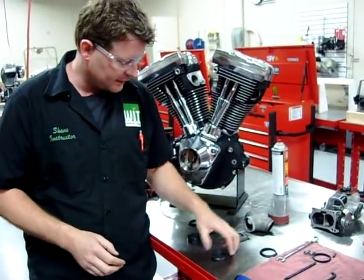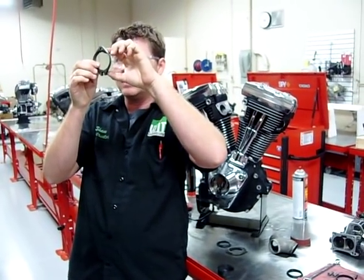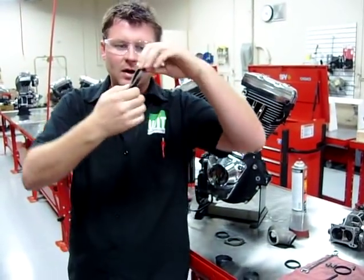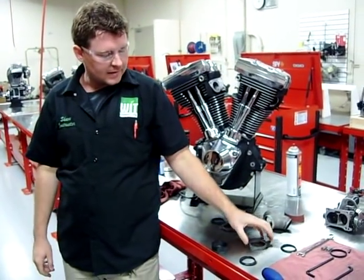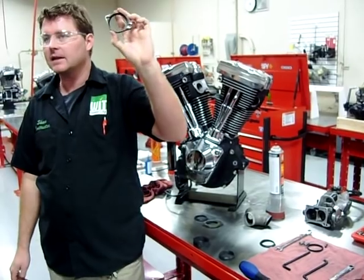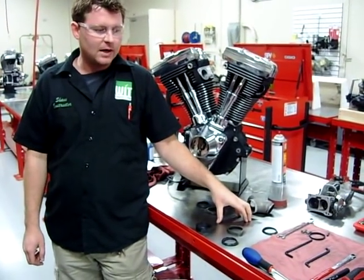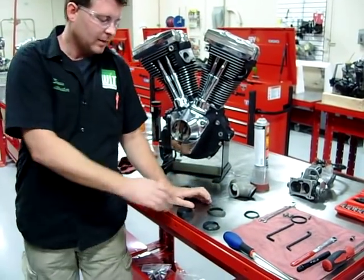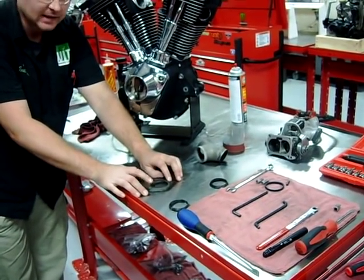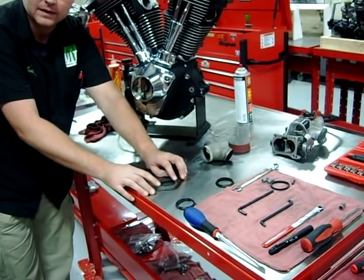Let's talk about other problems with Harley-Davidson intake manifolds. We only have two bolts and we're clamping down over a pretty large surface area. These work great if you do it right. If you do it wrong and you take one and pinch it all the way down and then try to pull this one over, this flange is going to bend — and these do bend. A lot of times, especially on a high-performance motor, I just put new ones on. You can buy S&S or other brands; I think 30 bucks or so you can get a new set of flanges, chrome if you want. What we want to do is check flatness — this bench does not count as a true surface plate. We'd go to a piece of glass or a surface plate, put it on there, and see if we get any wobble. Do you see how this one's actually pretty flat? We're not getting a bad tip or anything out of it.